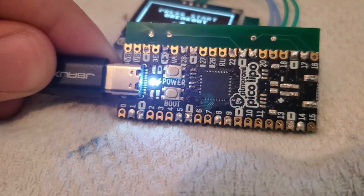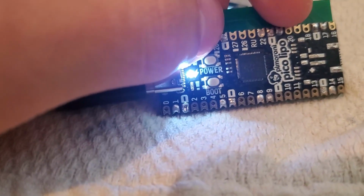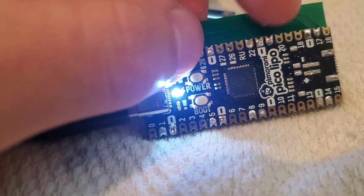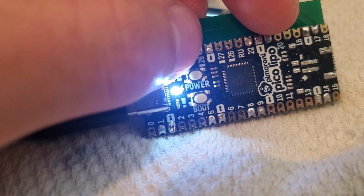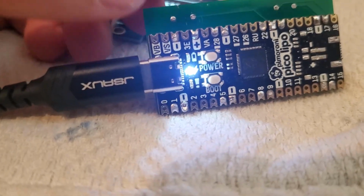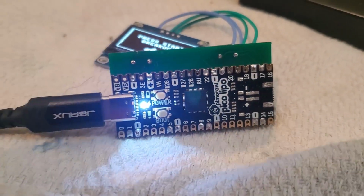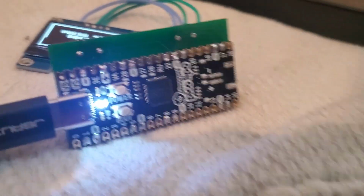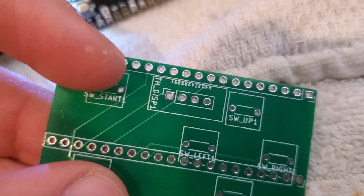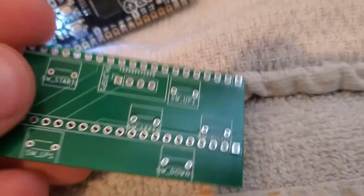If you look at this, you have to solder everywhere where I have metal, with the exception of this one right here to the right of the ground, or the minus. This one I soldered by accident. You do not have to solder that one. That was a mistake, but everything else you do. So there you can see that. And if you want to, you could also just look at the PCB, and everywhere a connection comes out of a through hole, that's where you have to solder on both sides. So that could also work.